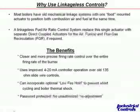One of the more significant benefits of the linkageless solution is that it's very difficult to tamper with. If you have an end user that tends to futz and play, and every time you come back for a tune-up you find things a little amiss, you can relax — a lot of linkageless controls today are passworded. There are serial numbers for the actuators, making it very difficult to accidentally change an actuator and affect the combustion settings.